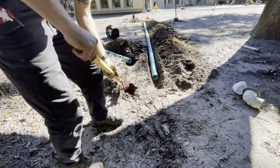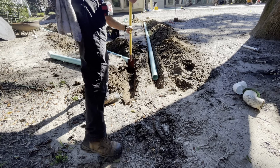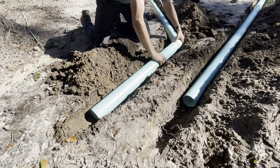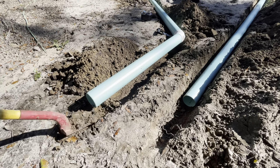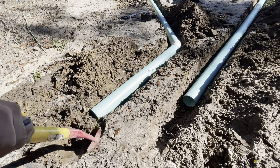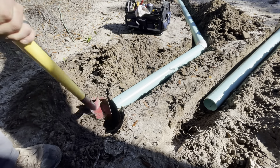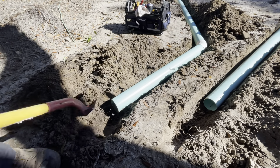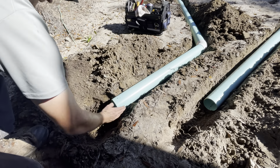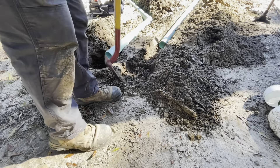Doing another 45 here — you can see what I mean about bringing these parallel together. They'll run parallel about 18 to 20 inches apart, which will be nice for the next guy. Just getting that angle in there, propping it up with the PVC saw, and digging out a little underneath it because my slope wasn't the way I wanted it. We're not doing a rock bed underneath these pop-ups because they're going to be modified in the near future. No point going through the extra trouble of putting stone underneath when it's all going to be changed. Just making sure it's packed nice underneath and moving on.